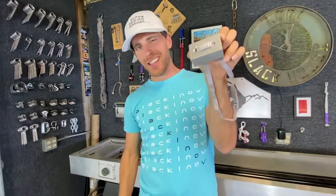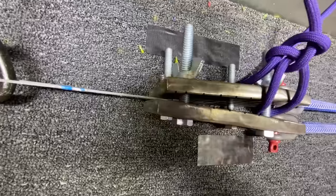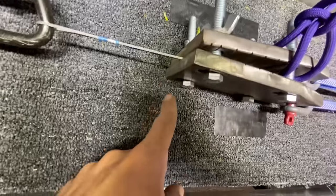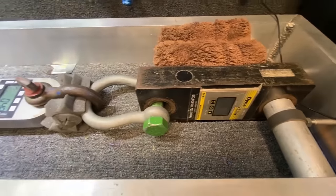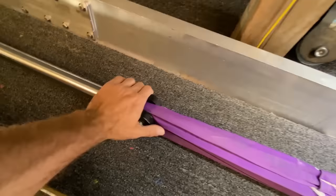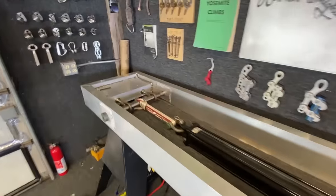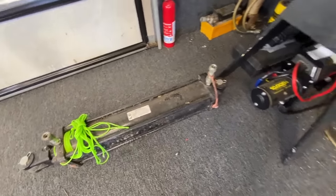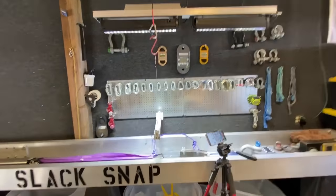We're going to show you the cam crusher adapter that didn't work great for cams. It was originally designed for active pro like cams — it's a little too slippery on the inside with those two plates — so it's perfect for passive pro. We'll start with the small brassy. We've got two shackles going to two dynamometers for redundancy. Our hydraulic setup makes it super nice for these lower break tests — anything under 90 kilonewtons uses the hydraulic, whereas we used to have a Costco winch and pulleys. We also have bolt buster gear for upcoming videos. Pretty neat setup in our new lab — let's get breaking.